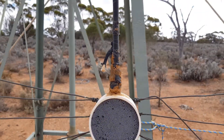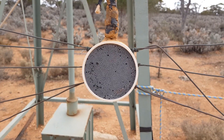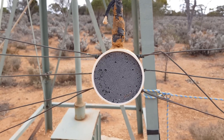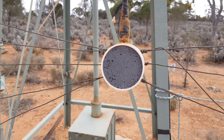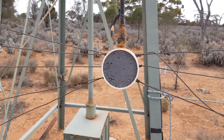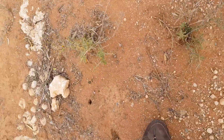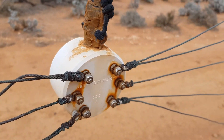My job now is to repair these wires. This thing here is called a balun — a balanced to unbalanced transformer — it goes from 50 ohms and matches each of those loops of wire which operate on different bands. It goes from 28 megahertz, 24, 21, 18, 14 megahertz — something like that. So it's a five-band antenna, even though a couple of these wires are joined to the same output lugs on the balun.